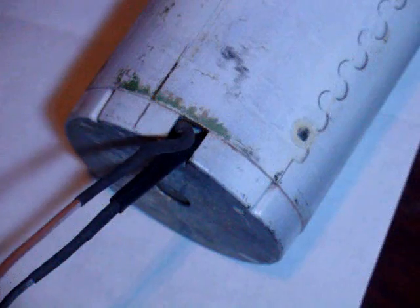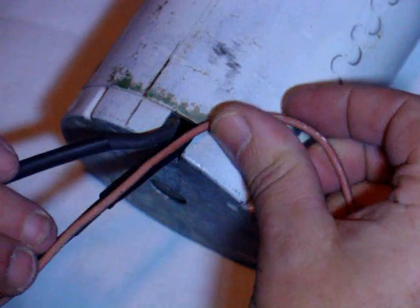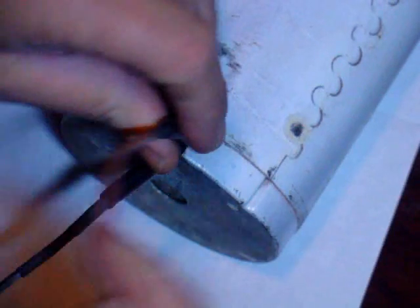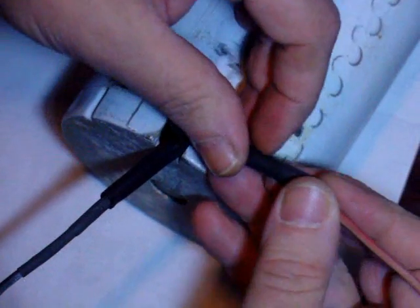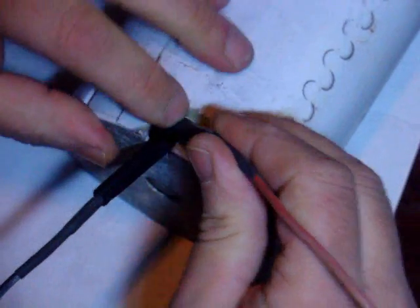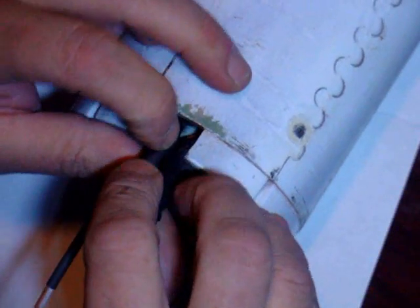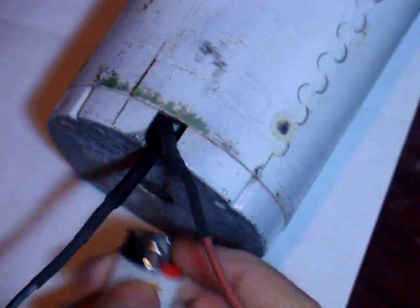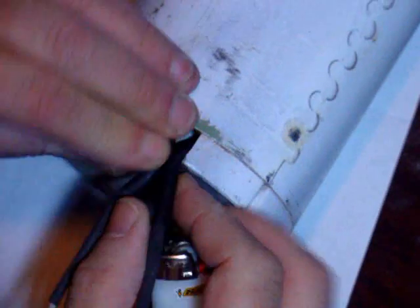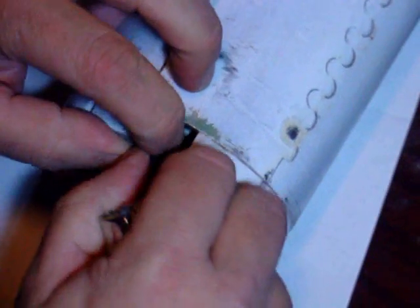There's my repair. About one more fat piece — I'll cut it in half. This one's down inside almost to the brush. Notice the wire is getting mighty fat now — it'll be almost twice the diameter, just insulation. That ought to be able to jump in here. It's getting mighty hard not just because of the thickness of the heat shrink but because of the size of the hole that's left. There we go — I call that stuffed. Those don't even want to pinch in between there. They're shrunk down pretty secure — I don't think they're gonna move or get in the way anymore. Now to round these little edges off. I'm Scott Brown, Greenwind and Other Home Energies — many good things to you and yours.